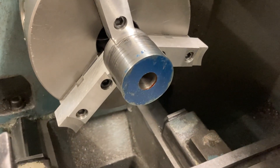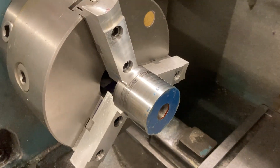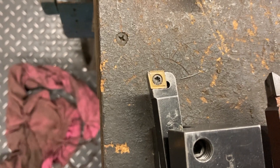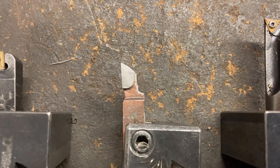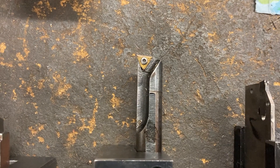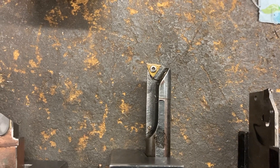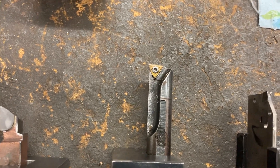The customer already put a big hole through it, so that's less material I have to deal with. Here's the process: Tool 1 — rough face and turn. Tool 2 — finish face and turn. Tool 3 — bore. It's not a complete bore; we're just boring that hole true and putting a 60-degree included angle on it so we can support it with a center when hogging out the V.